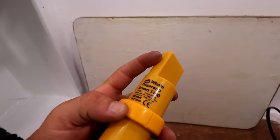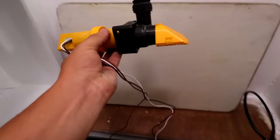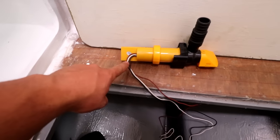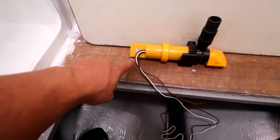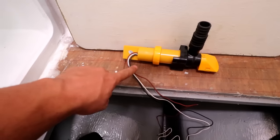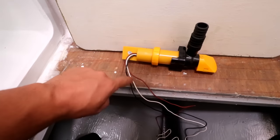And there's a little sensor in there for the water — so it senses the water. It's got three cables: the brown one is your positive, the black one is the negative, and the white one is the bypass. So the brown one and the black one work through the sensor to activate the pump. And then that white one sends another positive signal from a switch that you switch on and turns on the pump without the sensor — so in case you actually want it to come on without the switch activating, you send the positive power through that one.